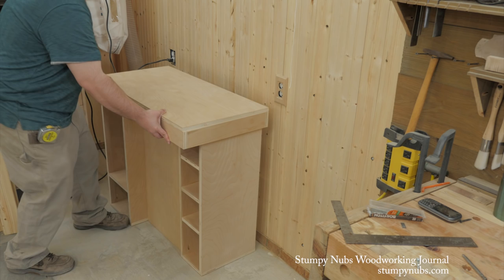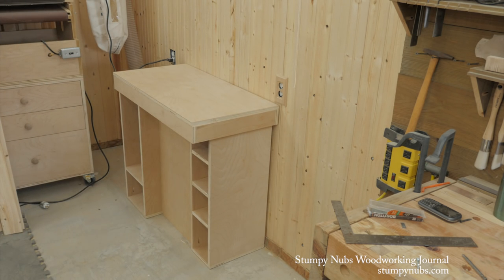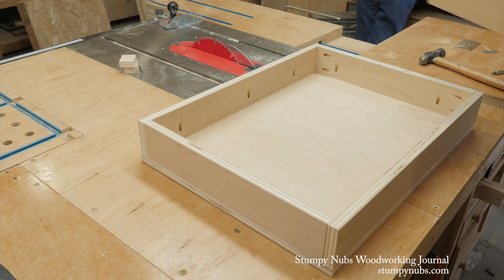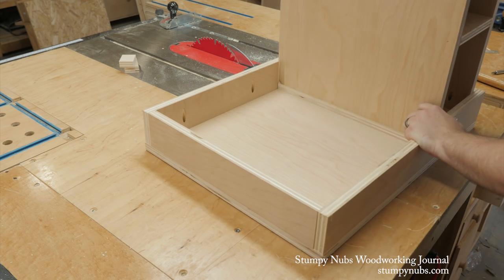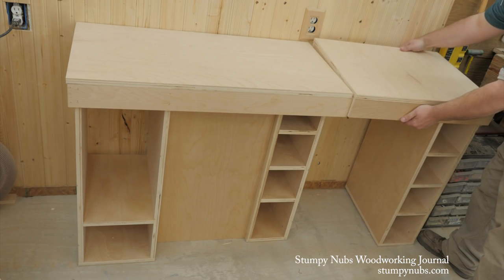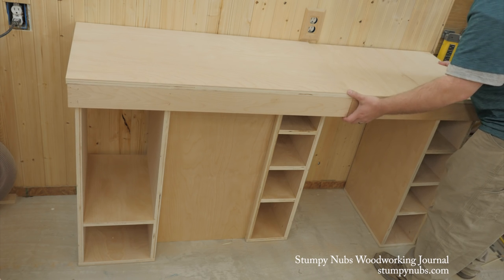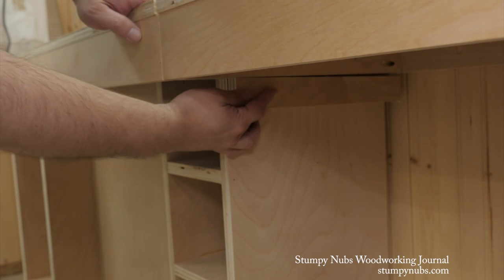This is the main section, and if you have a small lathe, you may just add your drawers and be done with it. But this converts into a full-size lathe stand with the addition of an extension. The extension section only has one column to support it, done to allow more room for storage underneath. You may think that this is a weak point in the overall design, but lathes are designed so that all of their weight is transferred to the legs on the ends, so the connecting point between the two halves of the stand never has to support any real weight.